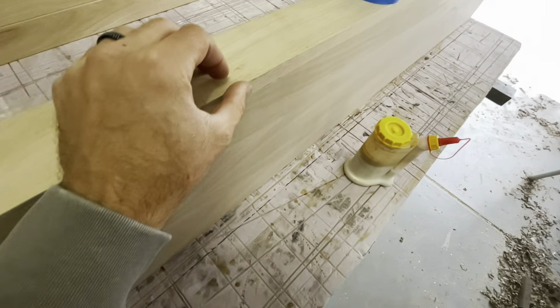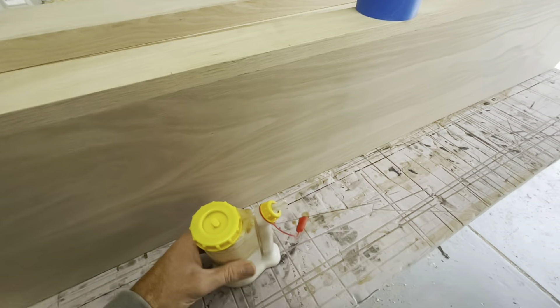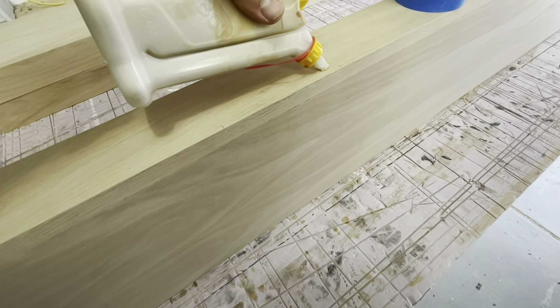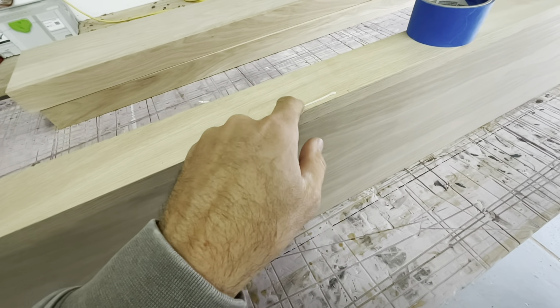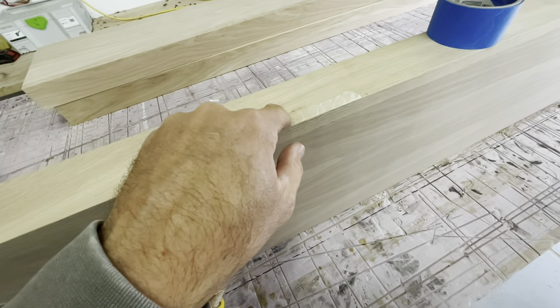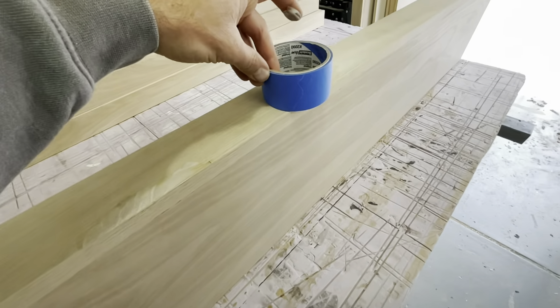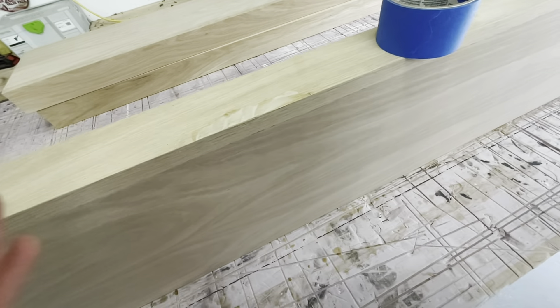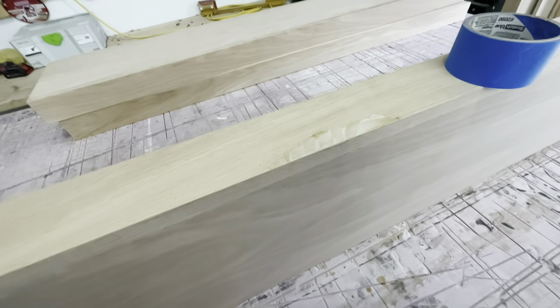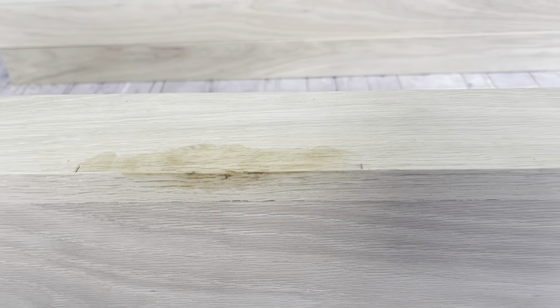There's a split in the grain — you can see a little crack. What I'm going to do is take a little bit of glue and run it along here on this end, and the other end as well. I take my finger and push it in there because it's lifted up a little. I'll also use my air compressor to blow it in deeper, then take a strip of tape, put it where it's dry, pull the tape over with some tension, and in about an hour that should be set and ready to sand down. The wood will stay in place and we'll never even know it happened. Just pull the tape off — can't even really see it.